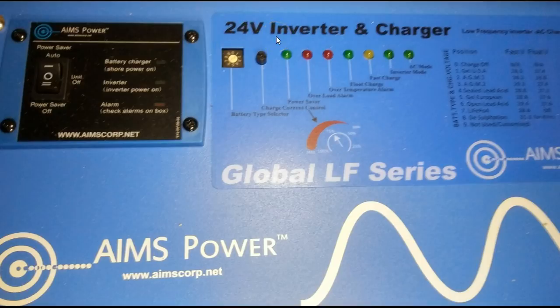Notice this one is 24-volt. You can get a 12-volt one, but a 24-volt system — wiring your panels and batteries from 12V into 24V — is much more efficient and will last a lot longer. It's like going from 110 to 220 on a major air conditioner. This AIMS is 3,000 watts average but peaks at 9,000. I've got this set up to run a 5,000 BTU window unit. That 9,000-watt peak allows the 30-second surge a compressor needs to start up.